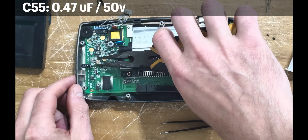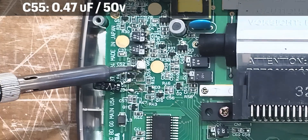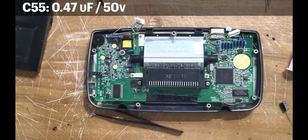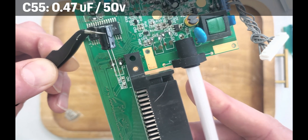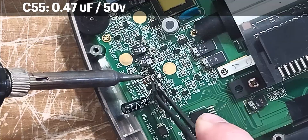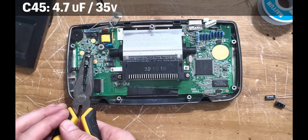Pliers work really well for popping the capacitor's glue loose from the board. Once they're broken loose, we can expose the legs of the capacitor by lifting it like a hood of a car. Now all we need to do is get a solder ball in there and watch it coalesce with the oxidized capacitor leg so we can break it free. We can tell which pad is positive by the plus symbol mark. If you're using polarized capacitors, you'll notice there's a stripe revealing its negative polarity — it's very important to match the positive and negative legs with the board. Before tinning the pad, apply flux to burn through the ancient oxide. The strategy is to tack one leg in place, direct the other leg where we want it, and then clean up the tacked leg after. We will be applying the same strategy to all the caps on this board.